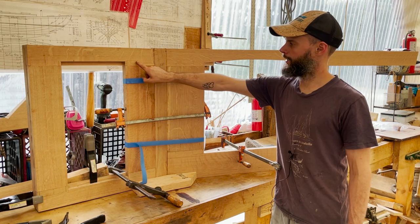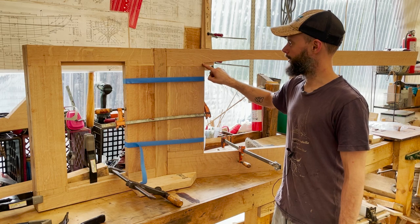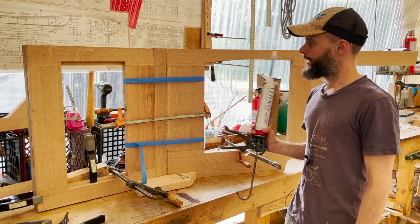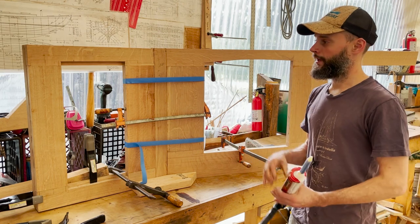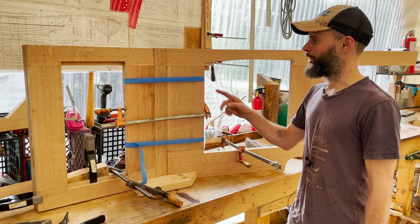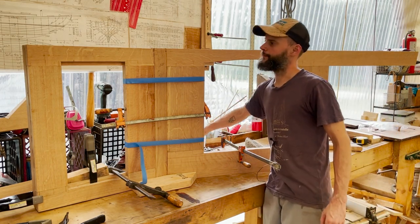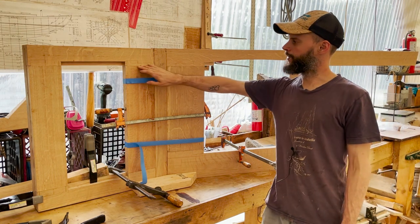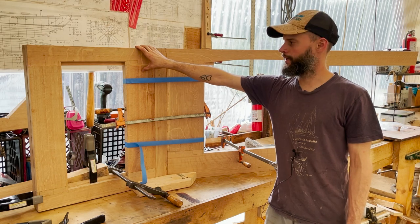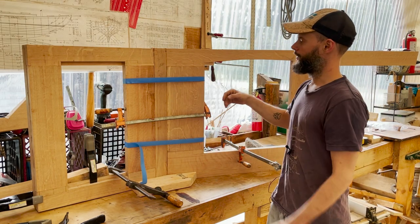And we just filled up the long tenon, just put a little bit of epoxy in the bottom of each long tenon when we assembled the frames. So I didn't film that this time, but next time we go around and make more panels, because we're gonna make more panels, I'll show that glue up process. We'll get this all in bits and pieces. But yeah, you just took them, got them a nice fit, put a little glue where the long tenons were, clamped these overnight, and then once the panels were situated and glued, fit them and glued them together.